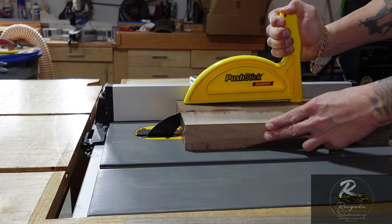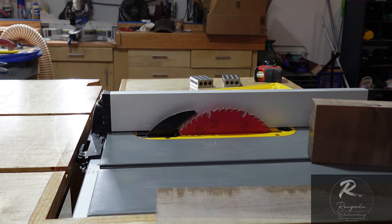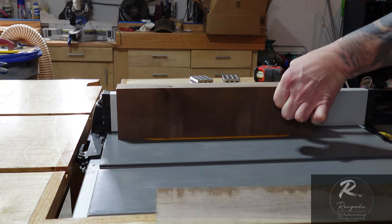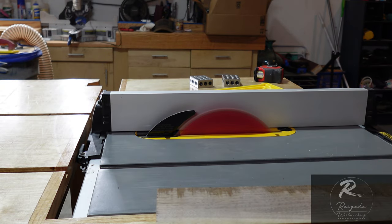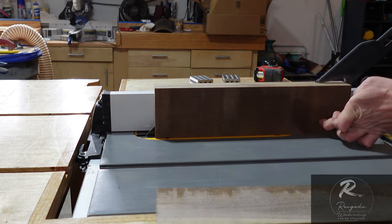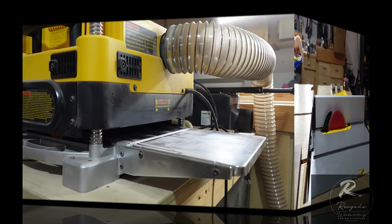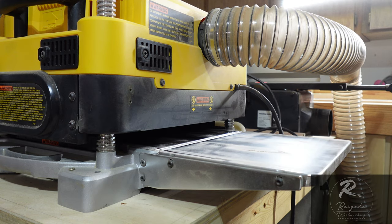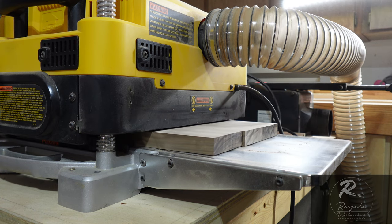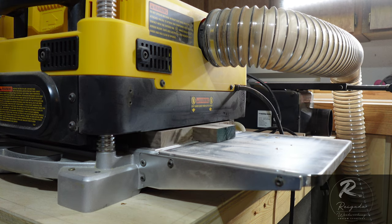This piece is going to go on both sides of a longer piece that will be used for the handle. I'm going to cut this down to about one inch thick. I really wish I had my bandsaw — it's still in my online shopping cart, but that's coming soon. Next we're going to go over to the thickness planer and get them all to an even thickness and same dimension, which makes the glue-up process a lot easier with less sanding later.